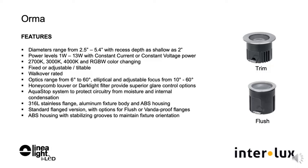Many models are available powered as constant current or as constant voltage at 24 volts, allowing choices to better match the specific application for such things as controls, quantity per driver, and distance voltage drop issues. The optics range from a satin diffuse to beam spreads of 50 to 60 degrees typically, plus an elliptic and even a focusable beam of 10 to 60 degrees.